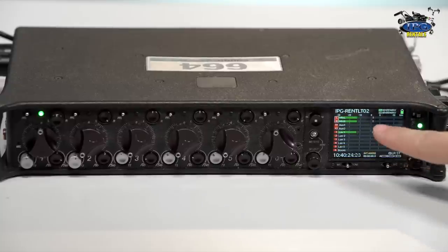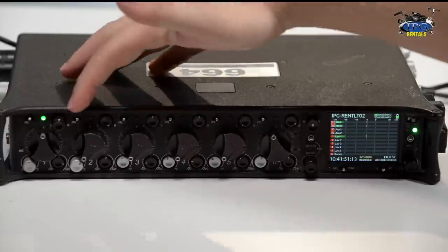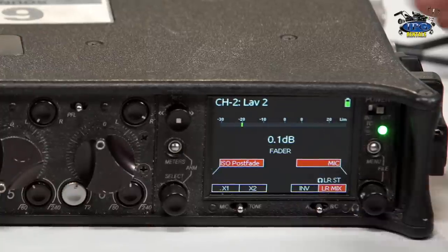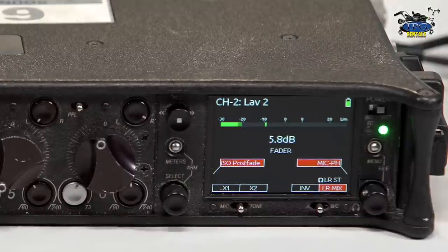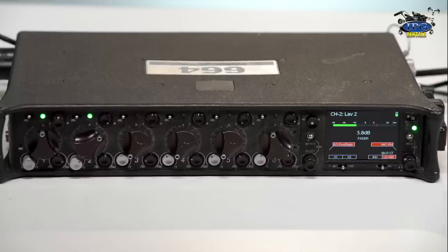So as you can see, we have a left and a right level bouncing and we have our lav one. Let's go ahead and activate channel two — channel two is going to require 48 volts of phantom power to make the microphone work. So we flip that pre-fader toggle switch over to the right. Right now we're in mic and you don't see anything. I'm going to turn up the fader and you're still not seeing anything right now. So I'm going to go ahead and turn this to mic phantom — here is the microphone right here, and you can see I'm tapping it. I'm going to put this to my face and talk, and you can see now that the levels are bouncing because we gave it the correct phantom power in order to make it work.